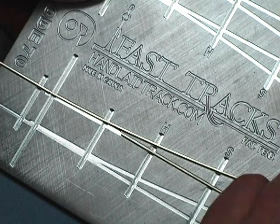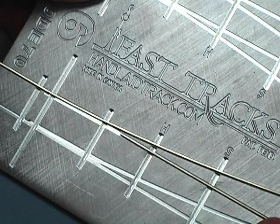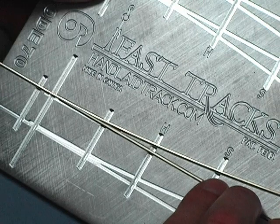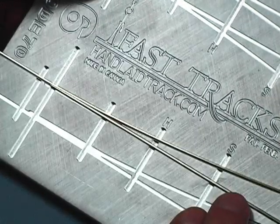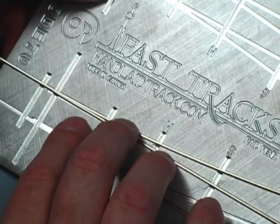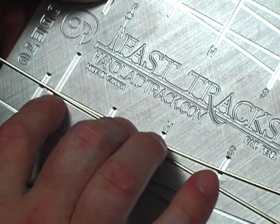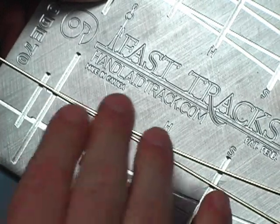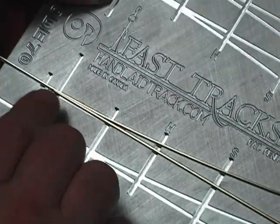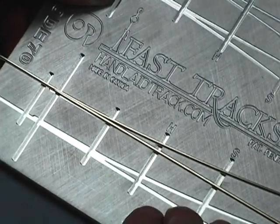Okay, with the filing done I'm just going to put the rail into the fixture. The stock rail is already sitting in place and I'm going to lay it in and do a test to see how well it turned out. I'll slide it forward to the end of the throw bar, and you can see how it's a nice fit down in here — nice and sharp — and that's exactly what you want. When the wheels come across here, they're not going to catch and not going to bump on anything. Part of the turnout fit process at the end of construction is we'll file a little bit of the inside of the head of the point off, and I'll cover that in more detail in another video.